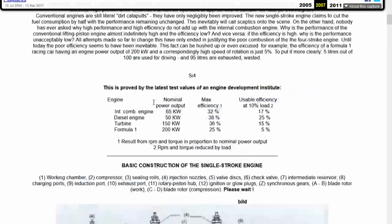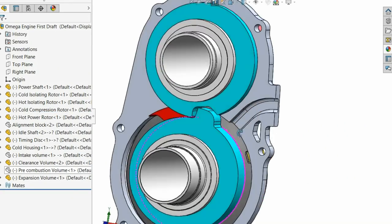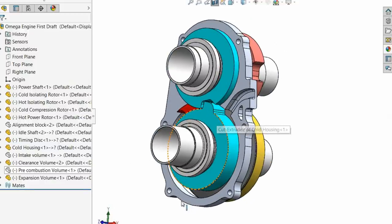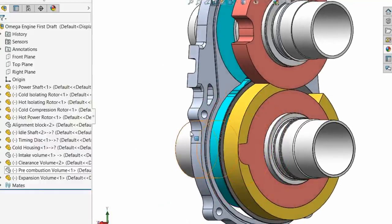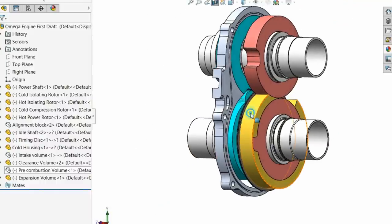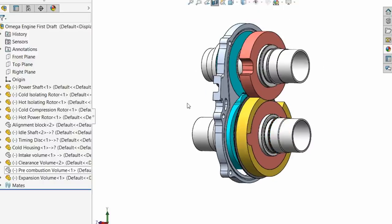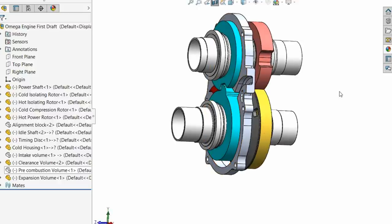But yeah, there's massive problems with the engine, full stop. My main concern with this thing is sealing concerns and thermal concerns. One of the other things as well, something I haven't done videos on but want to do pretty soon, is the surface area and heat flux, heat transfer in a combustion cycle. So we're going to compare this, because this volume here is about 630cc, to an XT660, because it's a single cylinder. We're going to directly compare the thermodynamic properties of that engine to this one, because they're so close in cc.